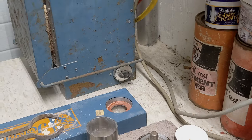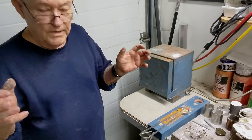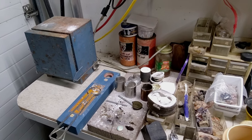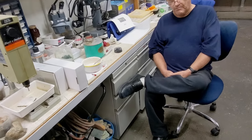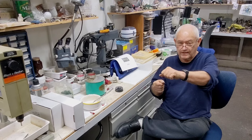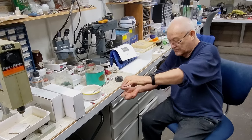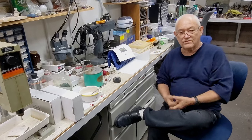At 245 degrees, we will turn it on full high. This will help let a little bit of the wax melt out and hopefully get some of that moisture out of there. Once it gets there, we can turn it up and as soon as it glows that right shade of red, we can take it out and cast it. I'll put that button on there, blow torch it again until it's rolling, rolling, and rolling. Then I hold on to the frame while I'm torching, and when it's rolling, the other person reaches over and pulls that lever out, which forms the vacuum, sucking the silver down in.